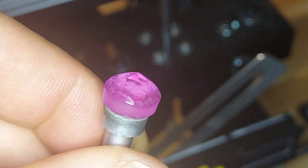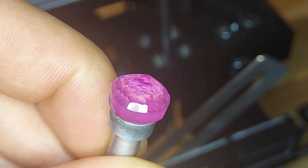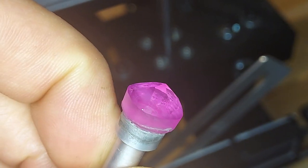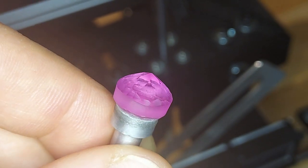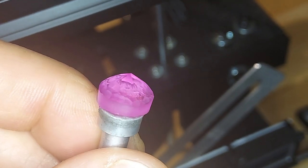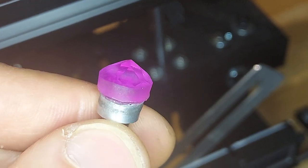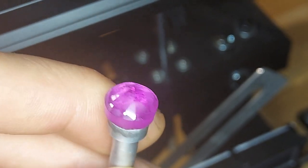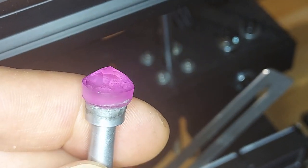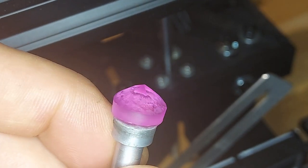I also have some edge facets that I added in here just to round out the stone, mostly because I wanted to experiment with how quickly it would cut smaller facets. So this is just a stone I've been playing around with. Anyway, thanks for watching — I'm going to post another video once I get the stone finished. I'm going to cut the crown but for now I just need to transfer it over, reload the machine, and program the crown cutting, which will be very similar to the pavilion with just a few changes to the facet angles and the length of time it takes to cut each facet.